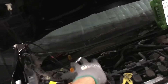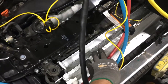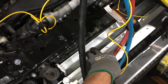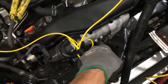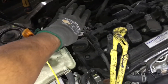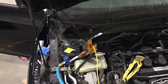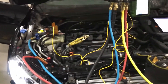The sensors are taking the air temperature of the mixed air — hot air that comes off the condenser, then gets heated further, hits the radiator, picks up more heat from the fans, hits the exhaust manifolds, picks up some more heat, then travels under here as warmer air and gets sucked right down into the evaporator on a cold day, giving me a nice heat load over the evaporator when it's too cold outside.